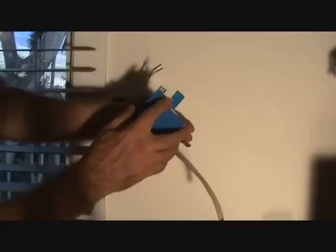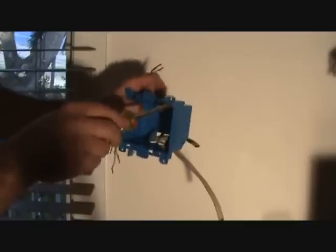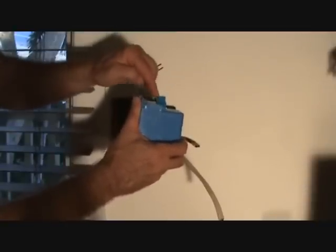If you're not checking this carefully, you might take this screw — when you take the screw here, you have the flap down and get ready to screw it, you go like that and it goes up. Now as you start screwing it, this starts pulling in. What could happen is if you don't have this flap out far enough, it could go up about like that and stick, and you think it's all the way up. Then you tighten it thinking you're tight, and all of a sudden it isn't on the backside of your sheetrock. So you want to make sure you've got plenty of gap at both the top and that bottom screw.